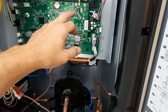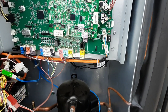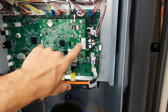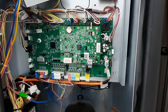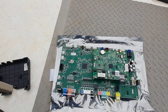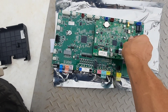They were trying to do an airflow setup on this new unit and they weren't able to do it because they couldn't connect via Bluetooth, so they said they needed a new board — even though the board was still fine. I'd like to know who was prying on buttons, but I'm probably not going to find that out. We've got it powered down, so we'll swap the board out and go from there. Pretty simple — there's the old board.